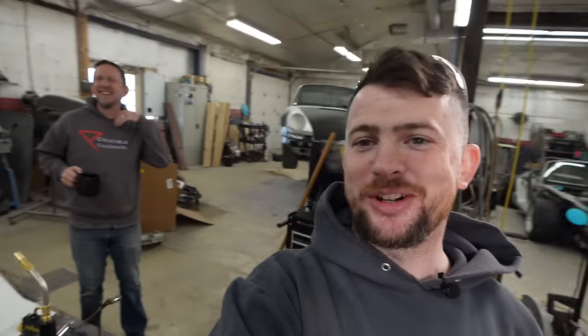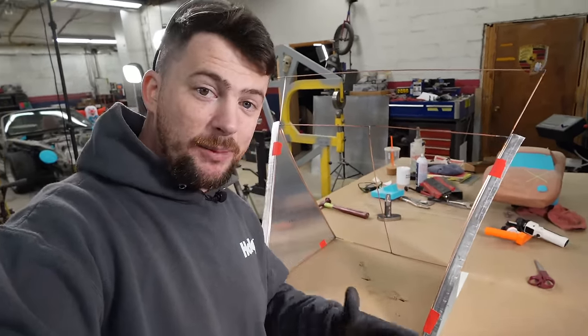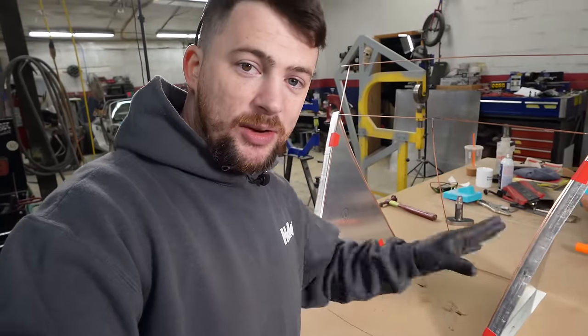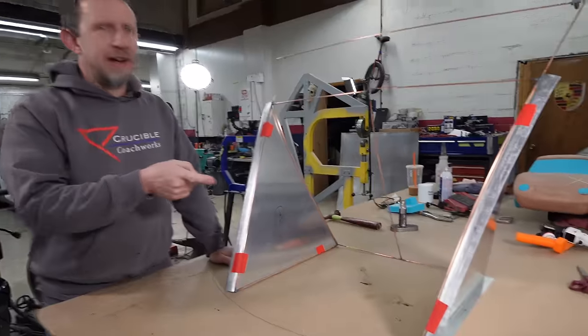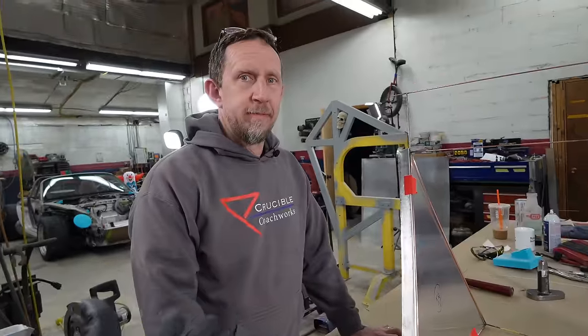You have a mic when you can't be slurping your coffee back there, Tony. One of the additional benefits of doing a wireframe is that I can tape the pieces as we make them to the wireframe to jig them up in place, so when we tack them they'll be in the right orientation. The side panels are made - they're roughed in and ready to go. Now we're going to make the back panel that goes to the back of the vent.